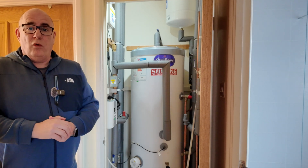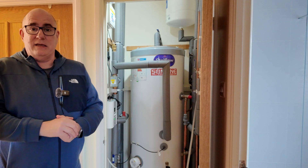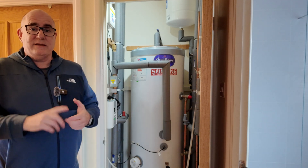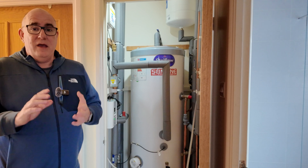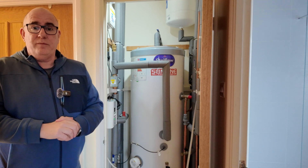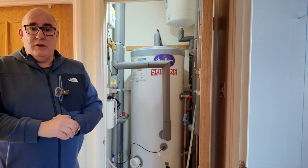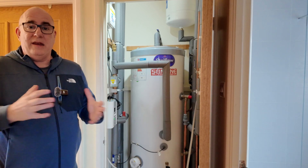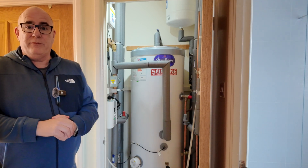As a last resort you can put the tank in the attic, but that will require a structural survey to make sure the attic can take the weight, which may add a bit to your cost. For oil boiler owners you'll probably already have a tank like this in your house to store hot water — it'll likely be a one-for-one replacement.